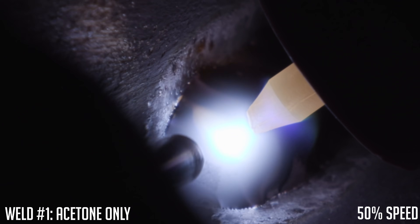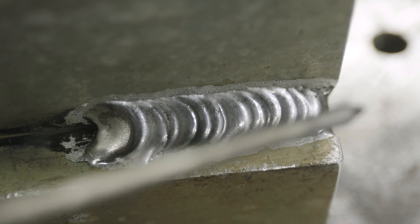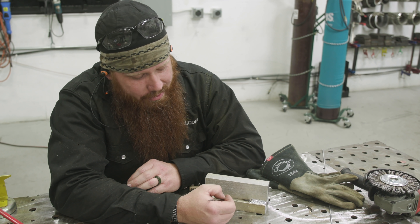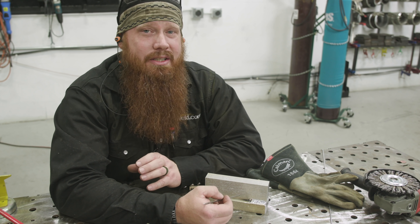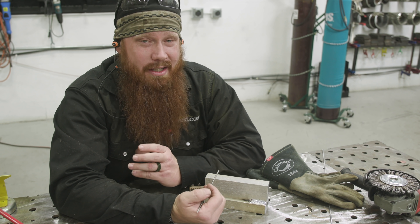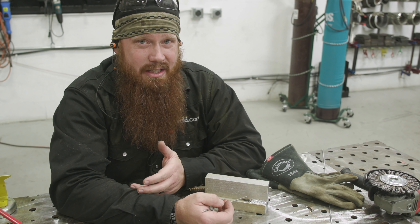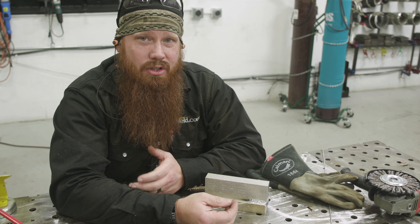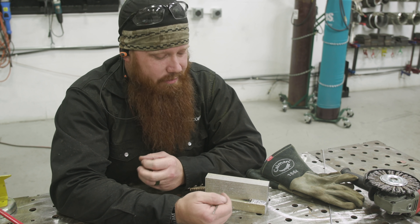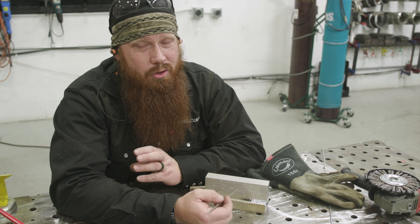That's why you want to take the time to clean it up. Even though aluminum oxide is very hard — almost equivalent to a diamond, I think it's the second hardest element known to man — you can clean it up very simply with a stainless steel wire brush. I'm going to clean off another area with a stainless steel wire brush in the way that most people do it, which looks clean but is actually deceiving. I want to highlight a common mistake: people say they've cleaned it with acetone and hit it with the wire brush and they're still getting contaminants.